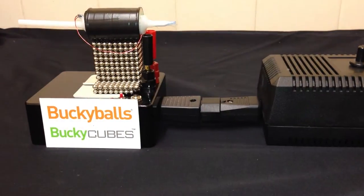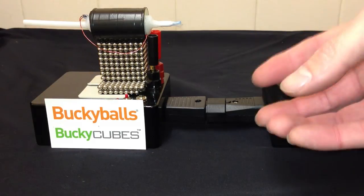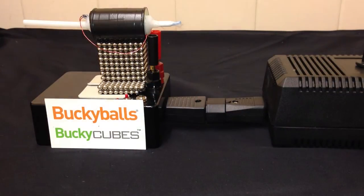It charges them up real quick. We'll connect it up and turn it on. It goes a lot slower because of the recharge — the recycle rate goes right down. You turn that all the way down until it's not flashing anymore, and it will keep the capacitors at 327 to 328 volts. The capacitors in here are rated at 330, so that's bang on — you don't really want to go above that.